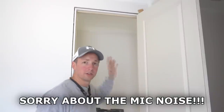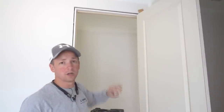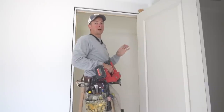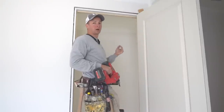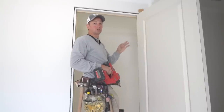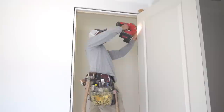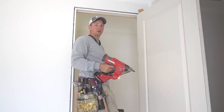Whenever you're hanging doors, you're always going to be making compensations for the framing being out of plumb. The question is: do you want to make that compensation up at the top corners or down at the bottom? You want your top corners to be as close to flush with the drywall as possible. If this is flush with the drywall at the top corners, it's going to make your miters for your casing much better and much easier to install. So I like to start at the top, get both top corners aligned flush with the drywall, and then start working the bottom to get it where it needs to be.